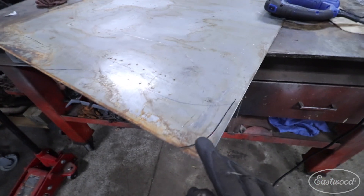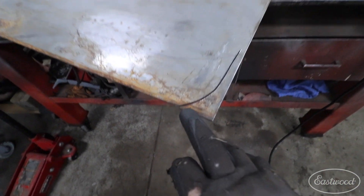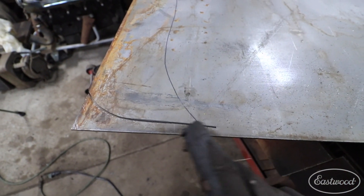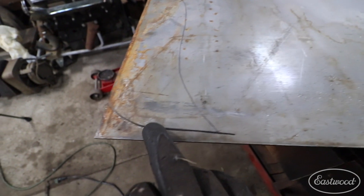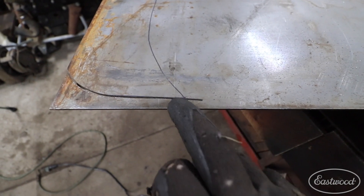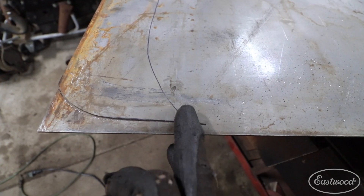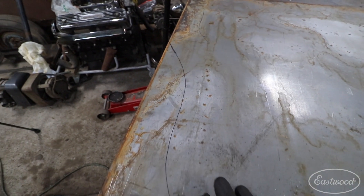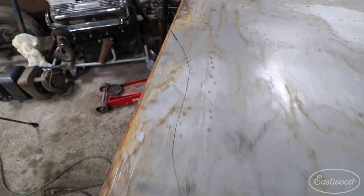I made my first cut here, and I wanted to give you guys a little tip that I've learned from using this jigsaw. You want to kind of plan out your cuts. This curve right here isn't that steep, but what we have here is an over-90-degree angle that we need to make for this cut. We wouldn't be able to do this all in one shot. So what I did is I cut all the way beyond where that tight corner is. Then we just come in just beyond that corner and make this cut to knock this little piece off. Then we can come in at an angle and start making this cut all the way across — it should work out really well, just taking two cuts. Most importantly, we want this cut to be as accurate as possible because it's the real long one that snakes along.